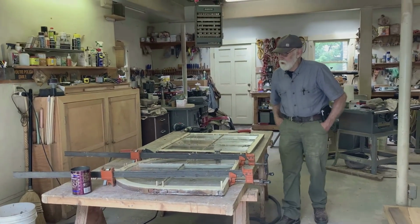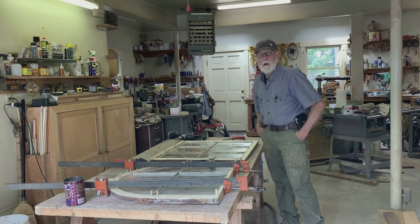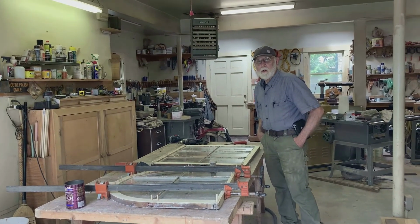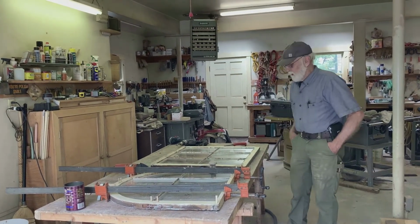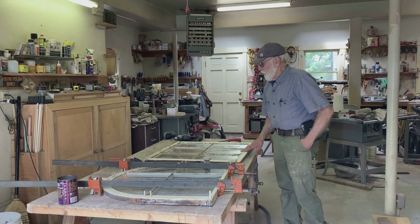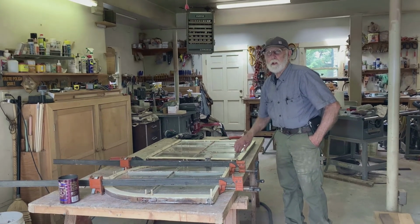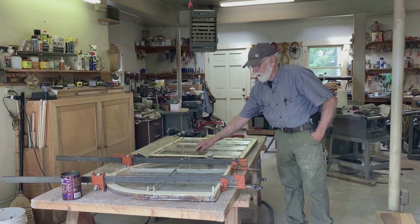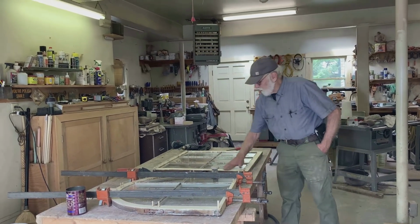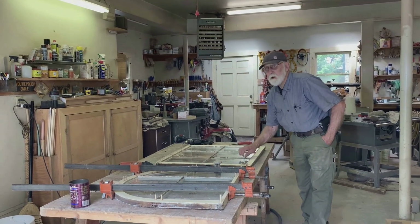I guess that's all I can show you today. And so once it's all sanded, then you'll just prime it and then bed the glass? Yeah, then it'll be like the first one that was done on the firehouse. After it's done, we just prime it. And I will prime in and around with oil primer to let it soak into all this old wood. I may scrape this a little bit more, but it's pretty smooth now, and I can clean that up a little bit.